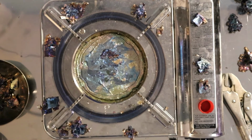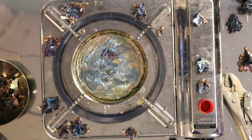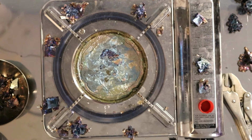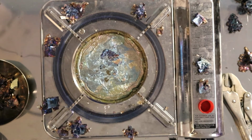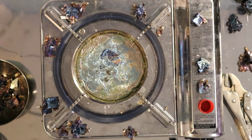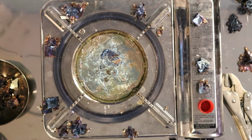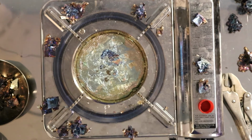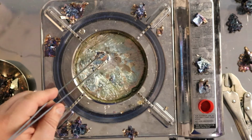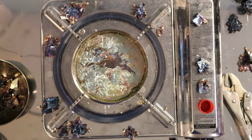Quartz might be interesting. If I really want to try to seed growth, and I actually looked into this a little bit, if I got a material that had the right sort of atomic spacing or lattice parameter as bismuth, I might be able to get bismuth to grow epitaxially, or continue the crystal structure on that. I'm not too sure what kind of materials I could use. I've only started to look into that a little bit. But I'm also skeptical that seed crystals are going to be quite what I want to do here. There's only so much I can play around with here, and that's one of them, so I'll probably want to try again.